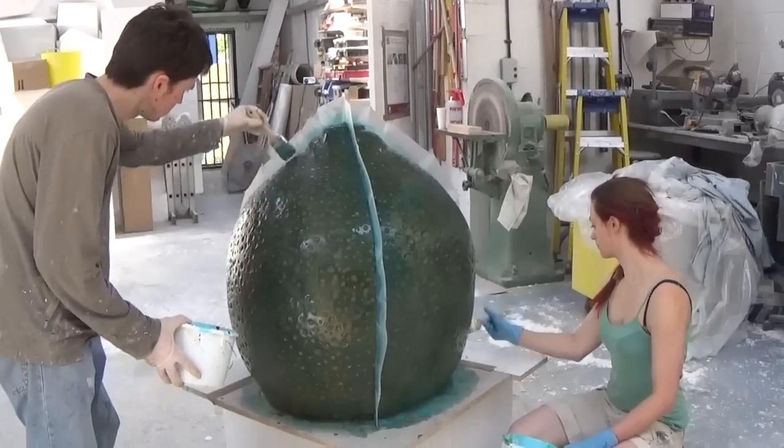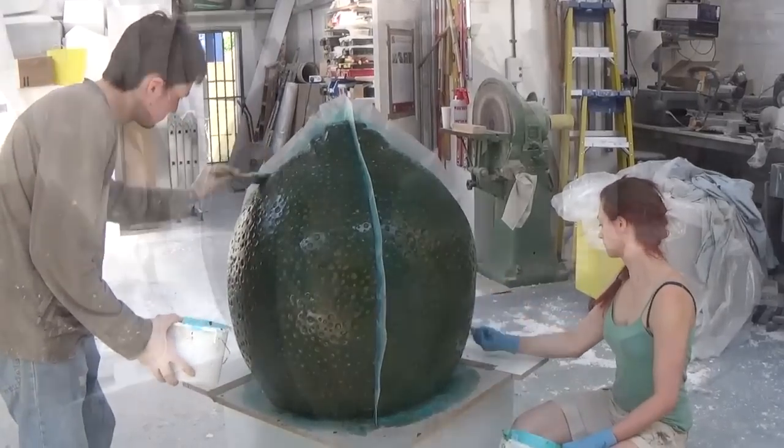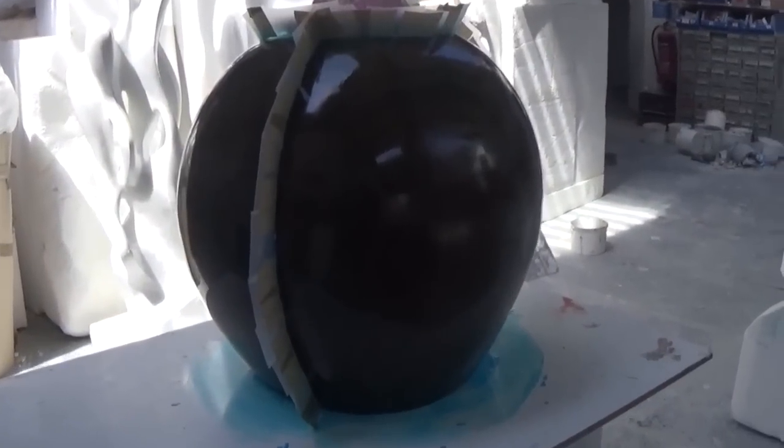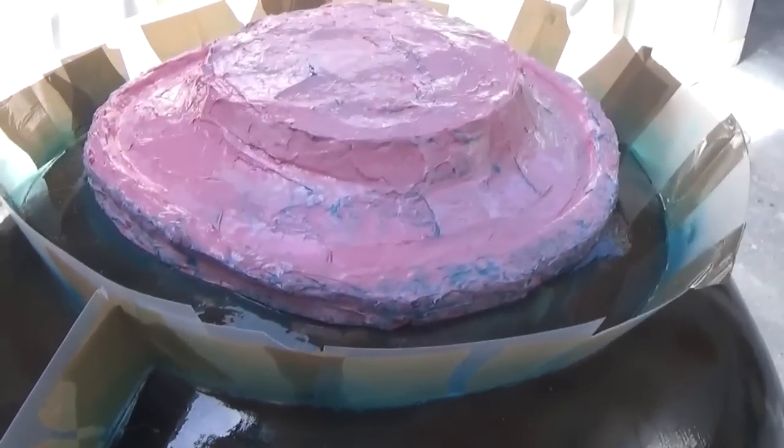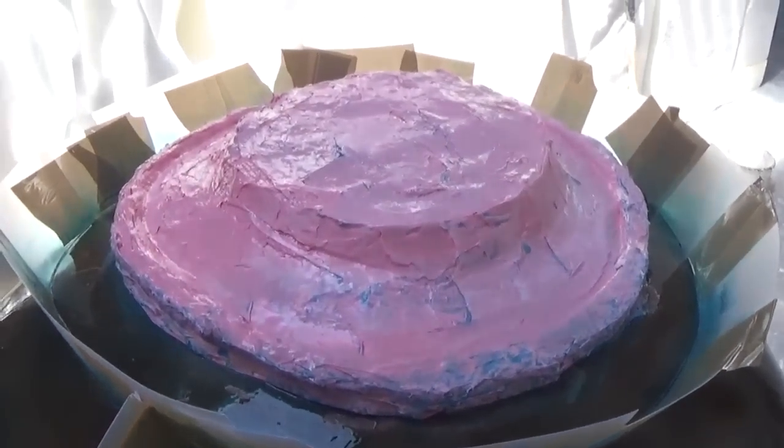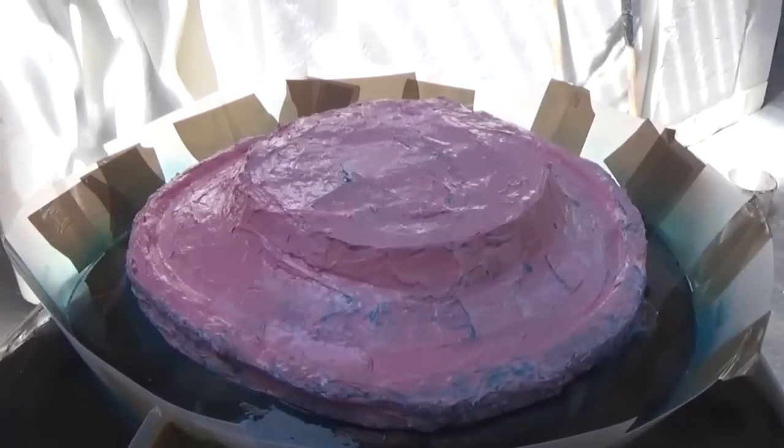We use a shim plastic material placed in thin split lines that we've made down the side of the sculpture, and these act as a wall that separates the mould pieces. When it comes to putting the glass fibre on, the shiny plastic material makes it so the fiberglass doesn't stick to each other as it's going off, and can just be peeled off once the resin is cured.